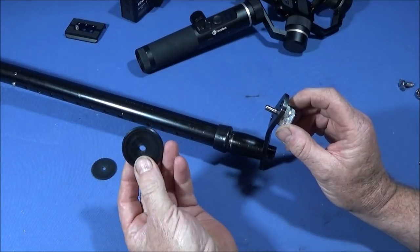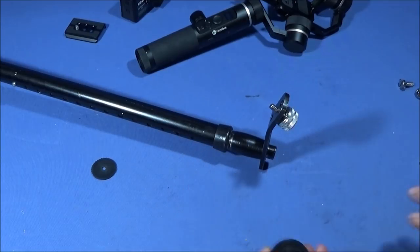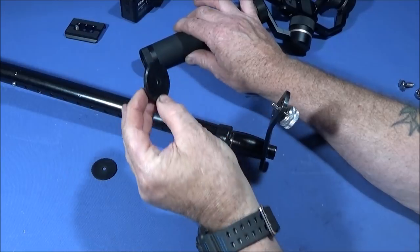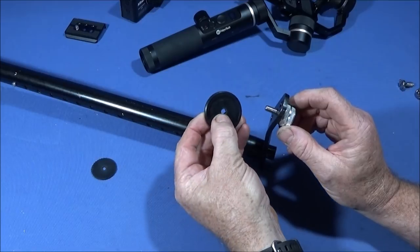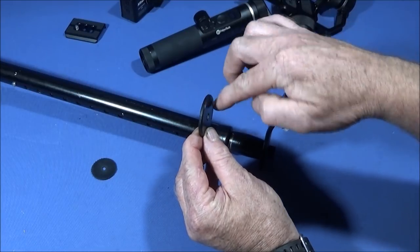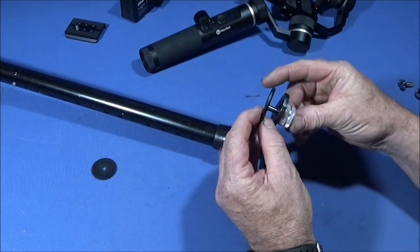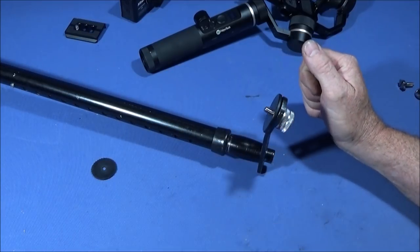And then I got a piece of PVC bar. That one's about 40mm in diameter, I think. And that one's obviously slightly larger diameter than the gimbal base. This one just pushes down over that one because I've drilled it to 1/4 inch, and I've parted this off from a piece of bar, put a couple of chamfers on the sides there before I parted it off, and I've parted it off to about 5mm thick. So that one pushes down over the screw thread and provides a base for the gimbal.